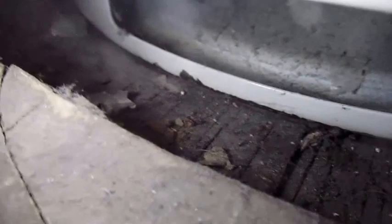I'm going to show you in here — it's kind of dark in there. But see, it's dirt — it's pretty dirty in there. I can't get my camera to see in here well, but it's real filthy in there. See the screen — there's a screen in there. It's a circle — that circle is a screen, that's where it breathes. And I looked underneath here — it's plugged, it's caked with dust. So the water heater isn't breathing, and what it's doing is shutting the thermocouple off, so the pilot light goes off.